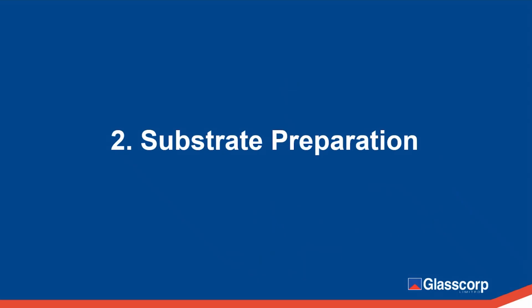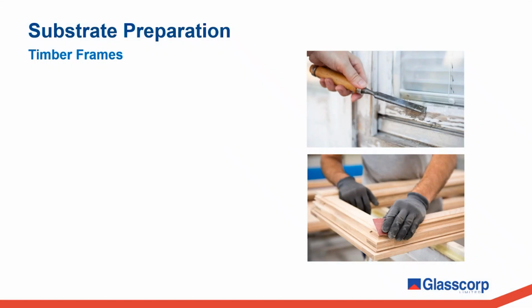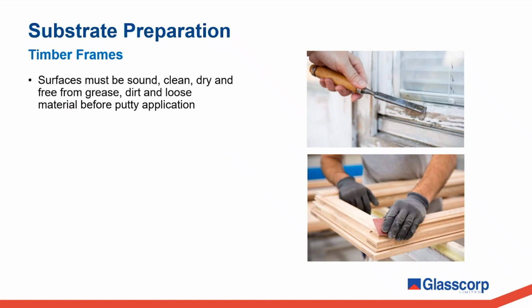In this next section, we will talk about the importance of proper substrate preparation prior to the application of putty. Starting off with timber frame applications. Any surfaces that are to be glazed must be sound, clean, dry, and free from grease, dirt, and any other loose material before application. If you're refurbishing or reglazing old timber windows, you'll need to ensure that all old and cracked putty and paint is fully removed and any uneven surfaces are sanded down.